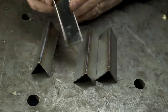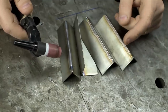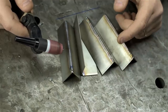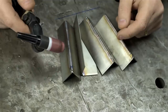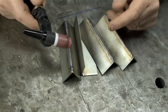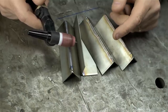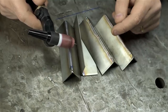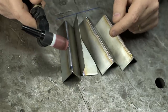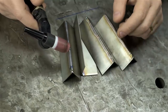This happened to be at 15 pulses per second and it was just on the edge of hypnotizing me — watching that light pop on and off, it's hard to keep track and see a very small puddle. But on thin stainless you could check the penetration on the back. Full disclosure: I don't use pulsed welding a lot. I think where it might really shine is when you're doing a lot of one kind of part — something you can fine-tune the settings for, write those down or store them in memory. When the job comes up, pull the program up again and you're off to the races. Though I do use it when really thin stuff comes around; otherwise I just default to the foot controller.